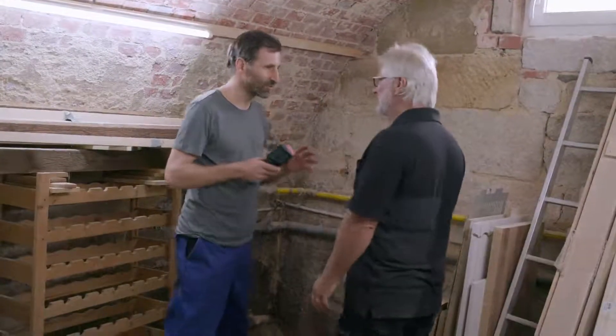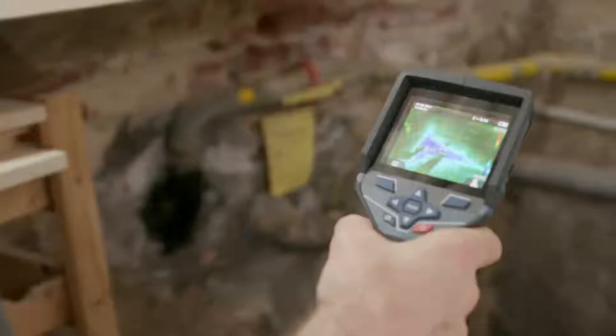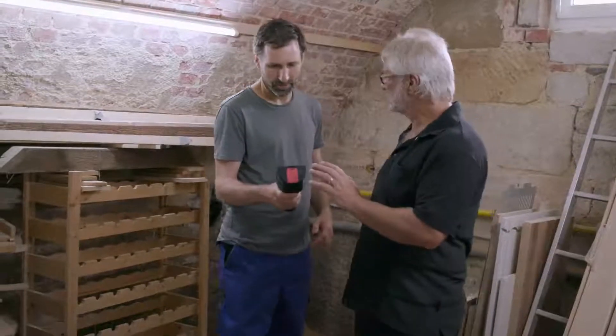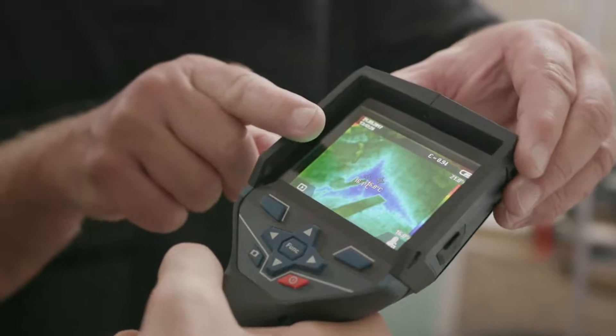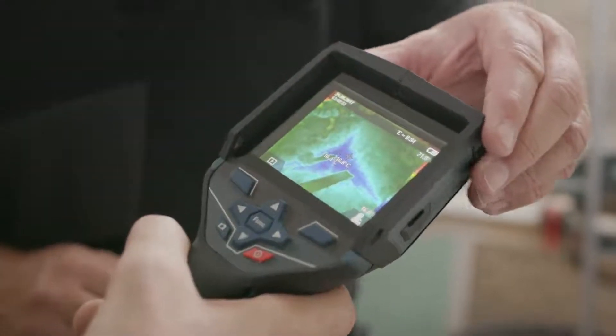Joachim, you might be getting a whiff of something here. There's a problem with damp in the walls — you can see it in this corner, for example. So now you know what to do: first, we get scanning and then we can look at the results. The most important thing now is that you can see the coldest point in the image here. It's very clearly a different color in the temperature display, too. But then you can also see the temperature around this point in the wall, which allows you to make a comparison.